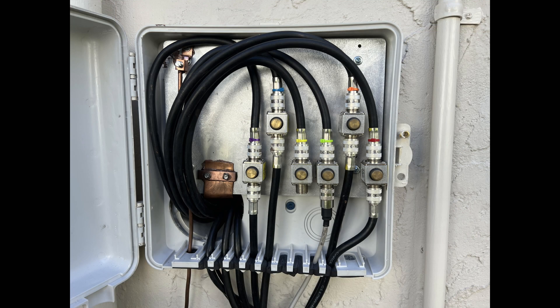The flat copper strap comes through the concrete block stucco wall — which of course I had to pound a hole in, and you'll see that in a future episode — and then it terminates in this flat piece of metal that comes with this distribution box kit. In the top left hand corner you'll see a heavy gauge copper wire that's attached to the flat piece of metal, and then that goes to the shack ground rod that you saw at the introduction of the video.